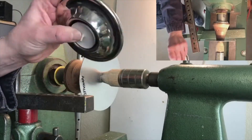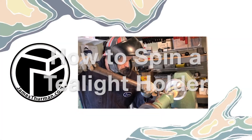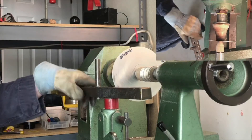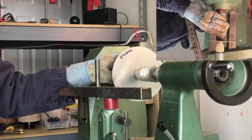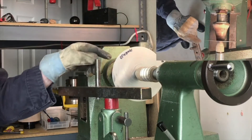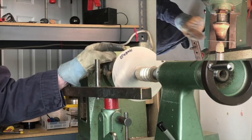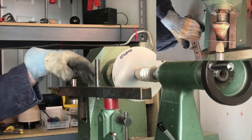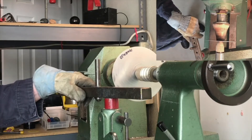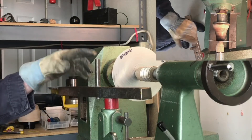I'm going to show you how I spin this tea light holder. I've got the blank centered in the lathe. I've selected the right size chucks for the candle cup and the follower block that's slightly smaller — that'll let me seat this blank up against the chuck well. I've also annealed it, which I'll cover in another video, and applied paste wax lubricant to make sure that the spinning tool doesn't rub up against the metal and dig into it too much. So we're ready to get started.